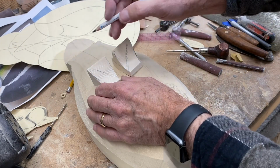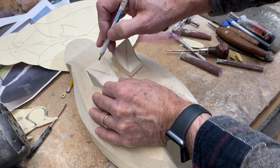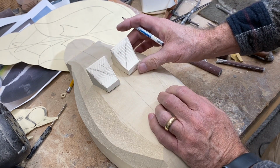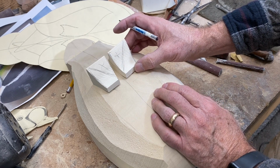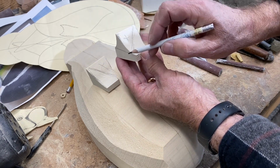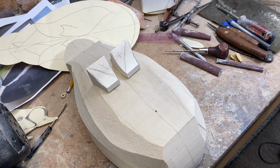All right, we've got those cut, and I can save myself a little bit of grinding by angling this piece and removing these pieces. I'm going to do that on the coping saw, since these pieces are getting pretty small to hang on to with the bandsaw. And I've got good area to clamp to down here, so we'll just take that off with the coping saw so we don't have to grind all of that material off. And then we'll be ready to insert these.